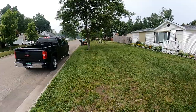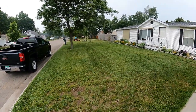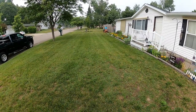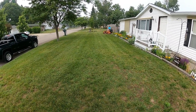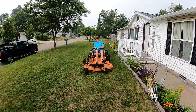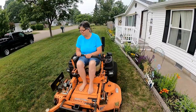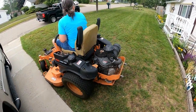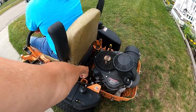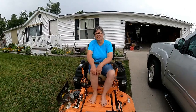These Scag's doing a nice job. That's as good as this lawn's going to stripe until fall again. I think I'm going to have to replace the belt - I'm hearing a squealing back here, so I'm thinking that belt's going bad. It makes an awful lot of racket. You know, that lawn looks pretty nice. Yeah, it does. Your puppy's watching again.